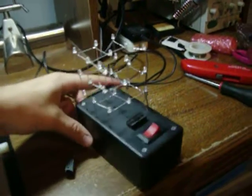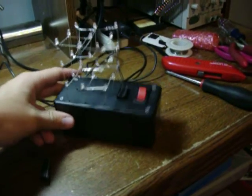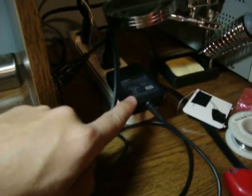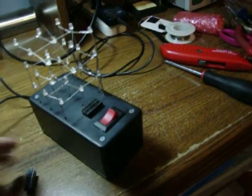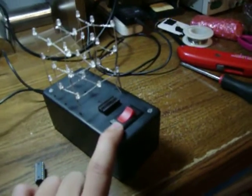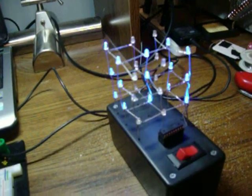Here's my LED cube project. I've got the whole thing mounted in a project box that I got from Radio Shack, and it runs off of a cell phone battery charger. It runs at 5.4 volts, which is fine for this circuit. I've got a socket built in that wires everything to it when I put the PIC in, and then I've got a button that I ordered by mistake because I thought it was a lot smaller, and it turns out to look really nice. Here's the PIC — it goes in the socket, and then I've just got a test pattern running.